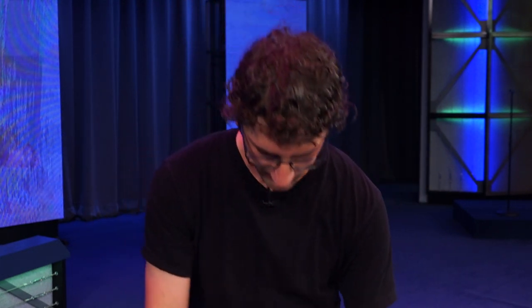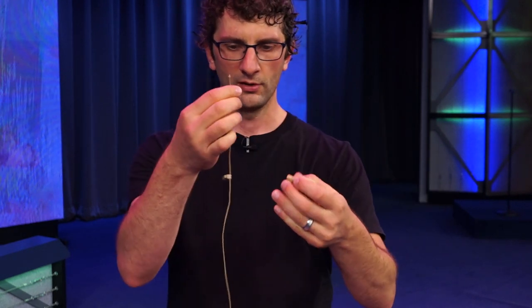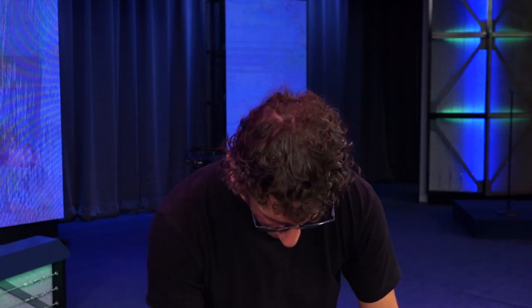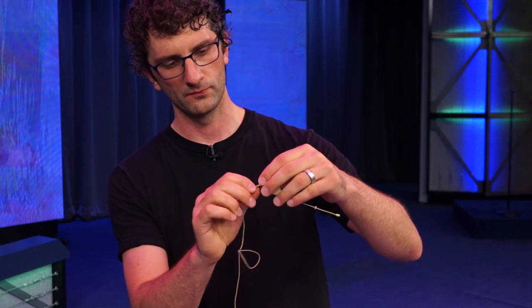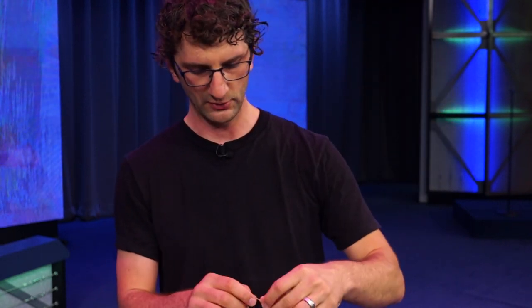To swap the cable: first unscrew this from the pack and pop it out. On the mic itself, you can leave it hanging loose — make sure it's already unplugged — then spin this off and it's now separated. You also want to take off the clip for the collar. This is now a bad cable — mark it, wrap it together, put a bit of tape around it so you know it's bad. Then there should be a spare cable in your little Mogan bag. Put it back in reverse order — take the new cable and screw it back on, making sure you get the tension out of it and that any knots are out of there.